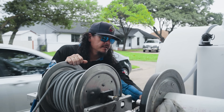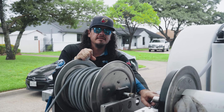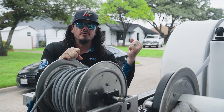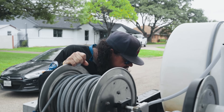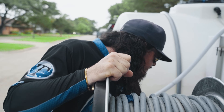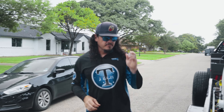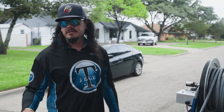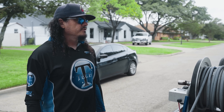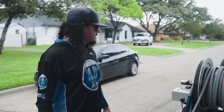This is a relatively new hose, but this machine cranks out a lot of pressure and I left it idling for a long time — it was constantly leaving pressure in this line except for whenever I'd pull my trigger. If you ever drop pressure in your soft wash gun, stop what you're doing and get over here immediately — because luckily this sprayed mainly on my trailer and somewhat in the street. If I would have been parked in the driveway, that would have run all over the grass and that could have been a big problem. Everything else looks pretty good — it's a total random occurrence, but be prepared for that kind of stuff.